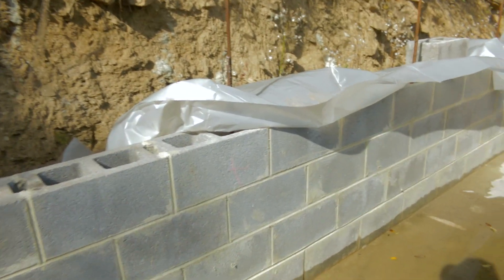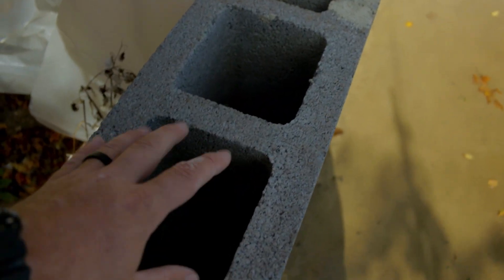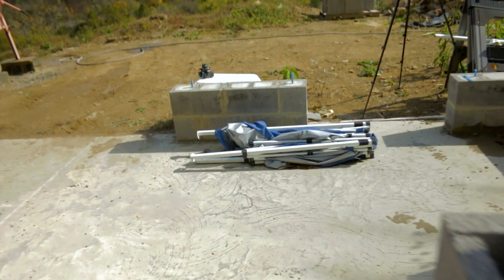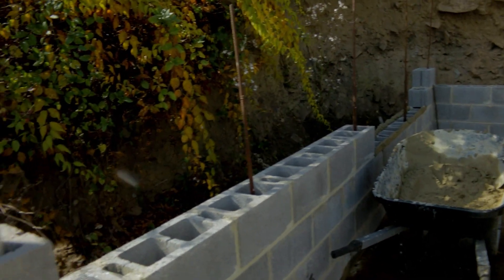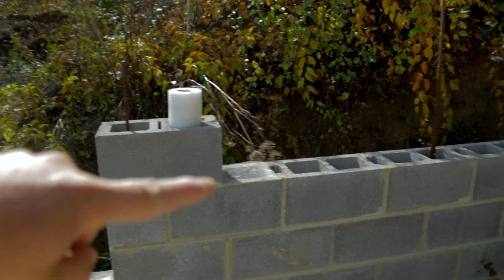What we've been doing also at night is covering this with plastic. We're getting to the point where it's starting to freeze a little bit up here, and it makes me worried that water will get in our cores and freeze inside and blow it out. So we've been covering at night just to keep all the water out of here until we get this bond beam down, and then we're good to go. So until we get to that point, we're going to be covering probably from here on out on every course that we do. We'll show you how we lay that grout stop down when we mud, and then we can start our bond beam course.